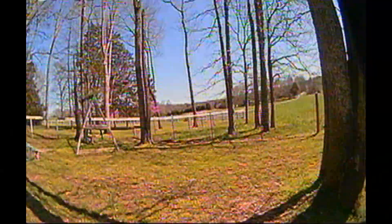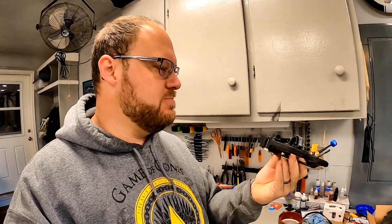Very happy with it. Long flight time — with 800 milliamp batteries on 4S I was getting five to seven minutes just out cruising around the farm. Really, really happy with it. So we installed the flight controller, did a test run in the front yard just to make sure it flew, took it out to the farm, flew it in angle and acro — it just does well. And I haven't even touched any tuning on it. I am ecstatic. I was so frustrated with this thing not running that the fact that I was able to solder in the new flight controller and it works — I am very, very happy.